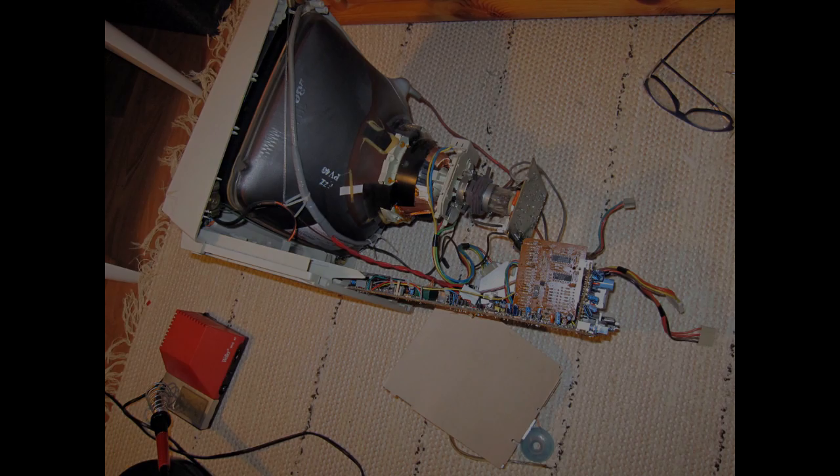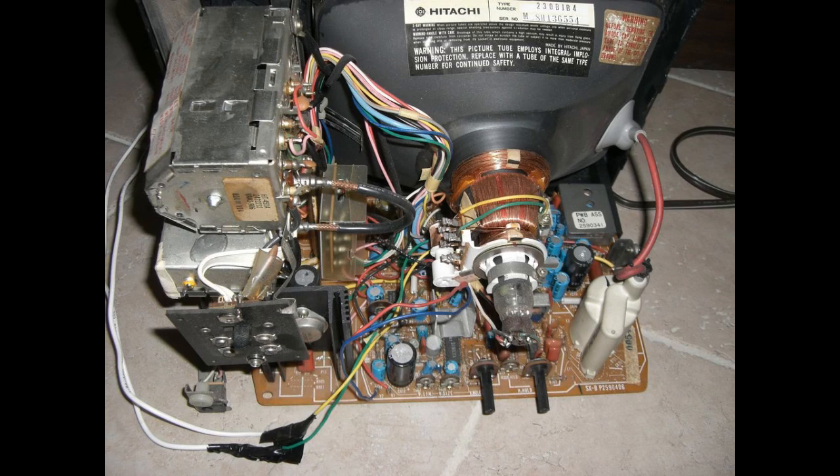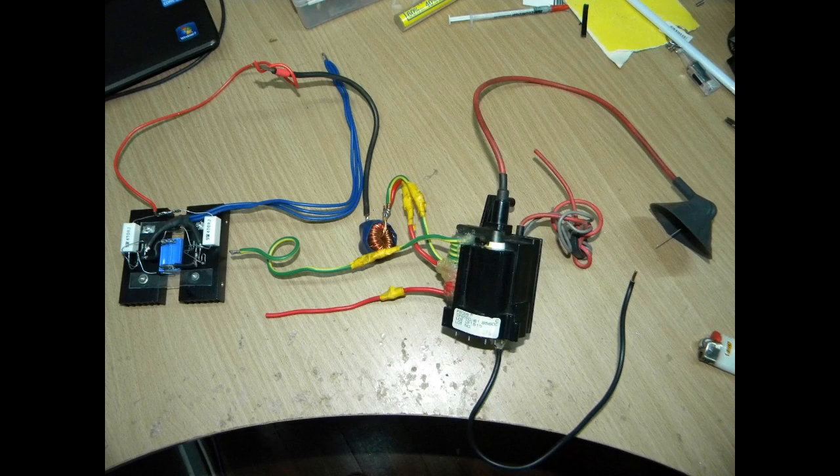They can output in AC or most commonly DC. They can be extracted from cathode ray tubes — which are big old fat TVs — to create high voltage arcs between 10-30kV at around 4-15mA. They can be used for all sorts of projects. They also need a special type of driver to run them, which I will explain as we get to it.